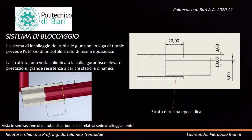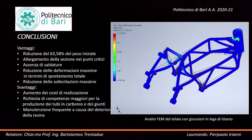After optimization, optimal joint dimensions were found: a seat length of 20 mm and external joint thickness of 3 mm. Epoxy resin is used between contact surfaces as the locking system; once cured, the structure provides high performance and resistance to both static and dynamic loads. Advantages of this frame include: elimination of welds, a 63.58% mass reduction relative to the initial mass, and strong reductions in both maximum deformation and Von Mises stress confirmed by FEM analysis. Disadvantages are higher production time and costs due to joint assembly complexity, and periodic maintenance required for the organic adhesive.